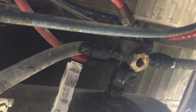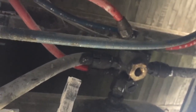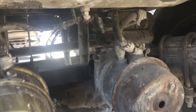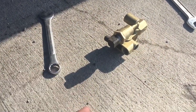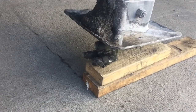Got all my tools out underneath the trailer. Here's the valve. I've already checked to make sure they're all a little loose and none of them are stuck, so I think we'll be okay to go ahead and take them all off and replace it. Found a truck stop with some dry concrete and it's sunny out, but it is 20 degrees. Dump your air out before you take that valve off or you're gonna have a surprise. Take some pictures with all those lines so you can go back and look. Make sure you switch all the fittings from the old one to the new one. I like to do this — it creates a vise while you're out on the road. Don't crush it with the landing gear, but it ain't going nowhere.